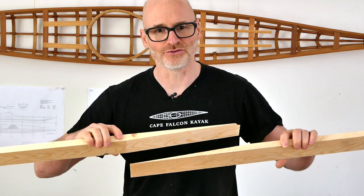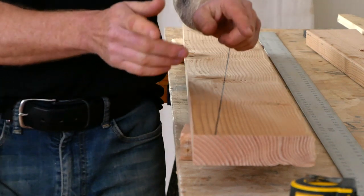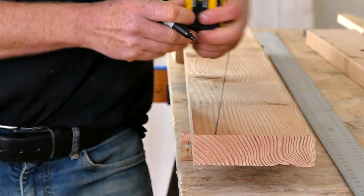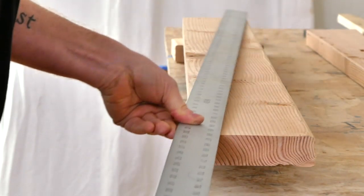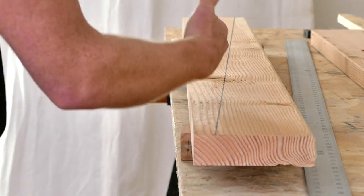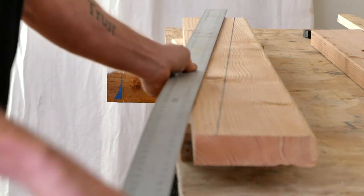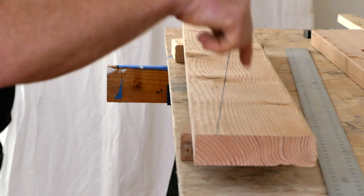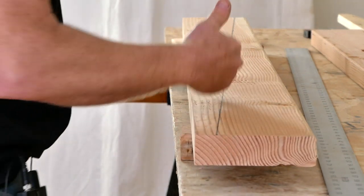Let's get started by talking about the jig. I'm going to start with a 5 foot long section of 2 by 6. It's important that this board is extremely straight, because if it's not straight, your scarf joints aren't going to be straight either. I'm going to come in an inch on one end, and then 4 and a half inches on the other end, and connect those two points with a straight edge. To cut that line, it's not accurate enough to do it freehand with a circular saw, and not safe to do it freehand on a table saw. You can clamp down a guide rail and follow it with your circular saw, or screw this down to a piece of plywood on your table saw at an angle — that's probably going to give you the cleanest, straightest possible cut.